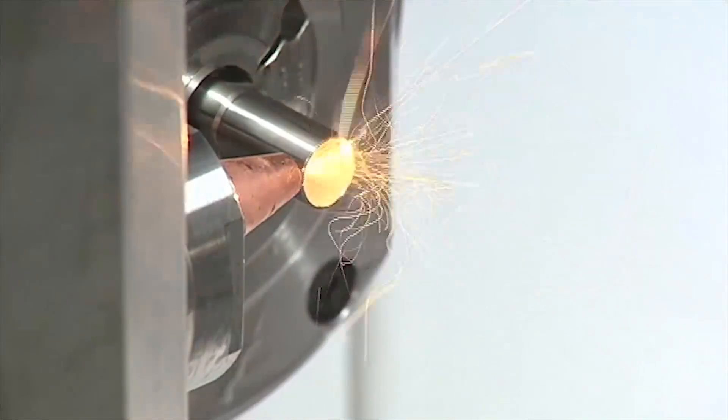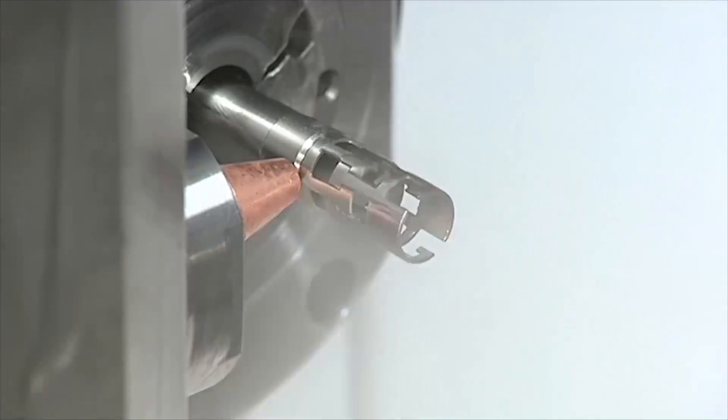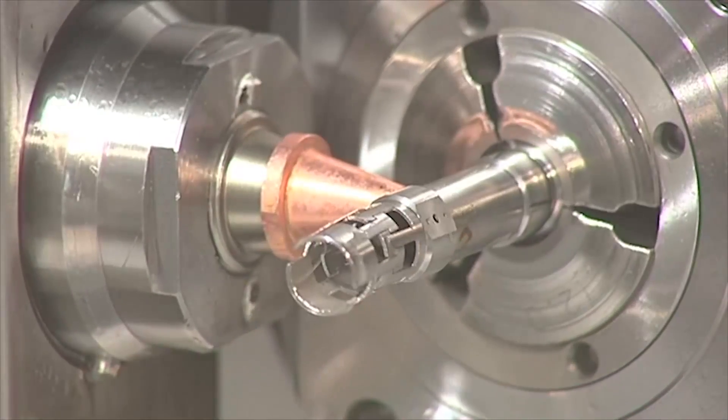Just over our shoulders here - we all know about low-frequency vibration, but one thing I've noticed on this video is there's some laser cutting going on. Laser cutting is a new concept for us - we're mounting a laser and integrating it to the machine. For thin-walled components, a big application is the medical industry, things like stents. There are a lot of applications across the industry where, when you've got thin-walled components that you can't pick up, you want to produce it in one operation, and the laser integrates into one of our sliding-head machines.